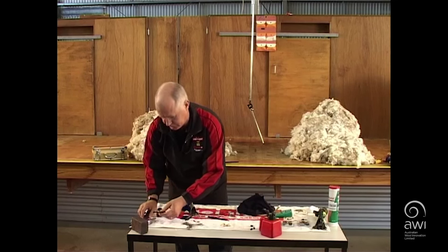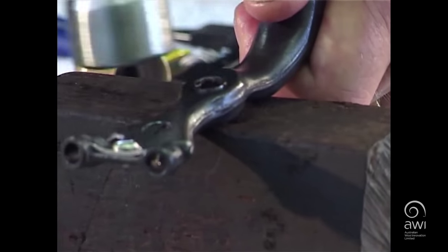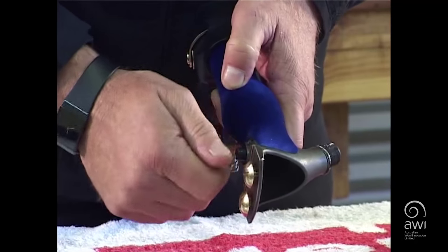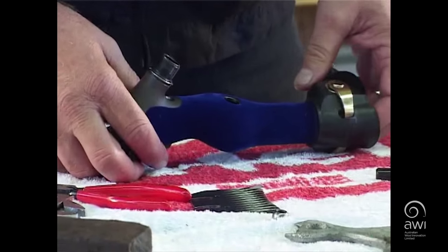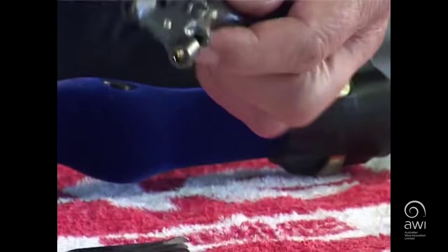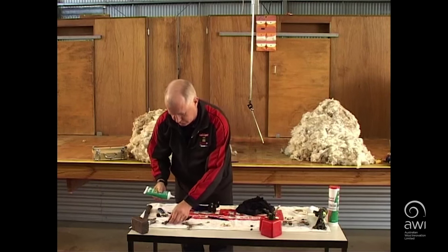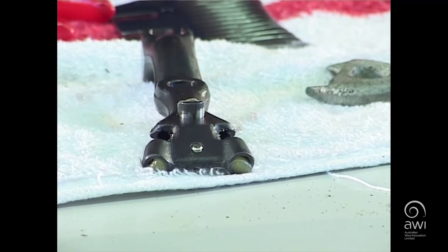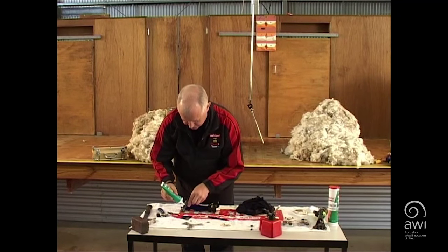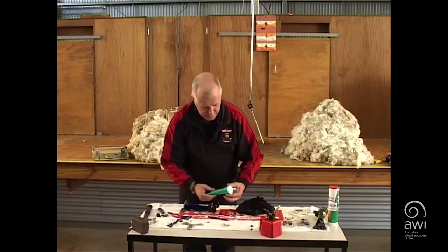Then knock it into place. Place the centre post cup into the fork and gently knock into position. Screw the new centre post into place. Leave the lock nut off or loose for now. Put grease on all contact parts, where the chicken feet slide, into the tension pin cup, into the centre post cup, and put grease into the ball race. Quarter fill the tension sleeve with grease.